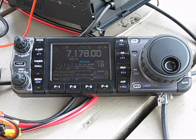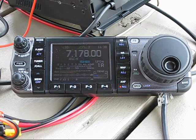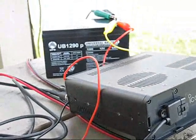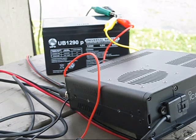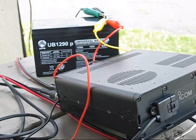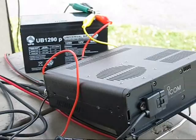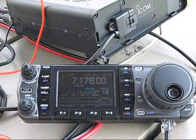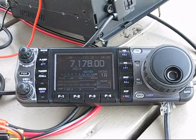What you're looking at here is an ICOM 7000 that has a detachable face. Right now I have it hooked up to an antenna and a battery over here. This is a small 9 amp-hour battery, which is more than enough for listening and some transmission, but it's definitely not enough power for full power output. You'd probably need to be hooked up to a car battery or a really large charging source.